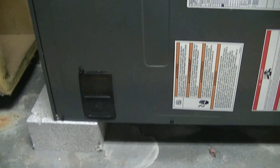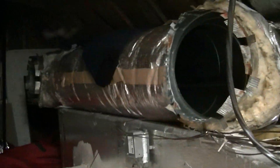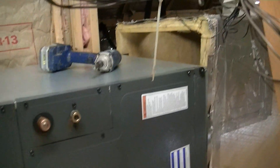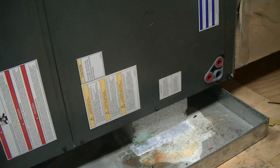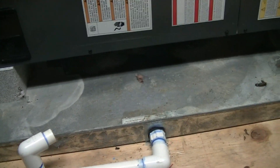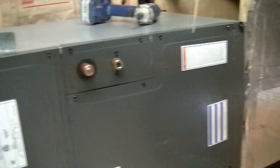Not quite in place yet — the blocks have to be evened up. We're connecting the old plenum; we're going to blank it off on the top, same thing on the front, fitted up to the old plenum. We've got the old bypass taken off; we're going to move it back across here and set it back down where it was before. Then we can braze in the copper and get everything finished out. Had to run a new drain from down here to this point — a little bit different location than before, but everything's going along good.